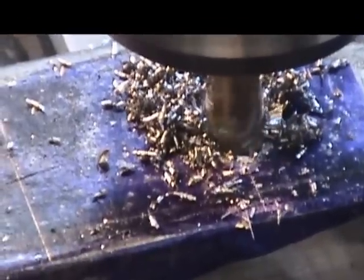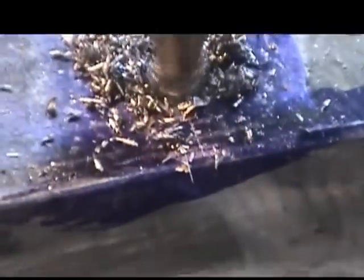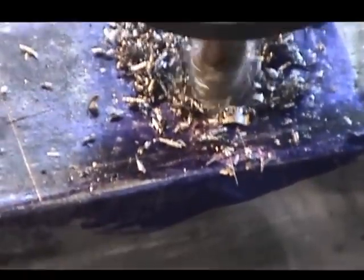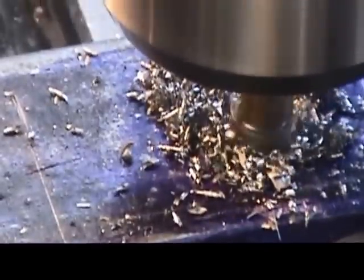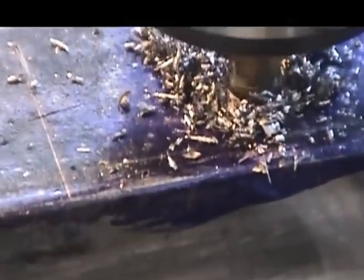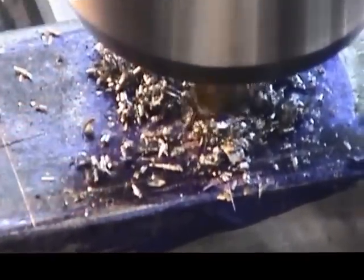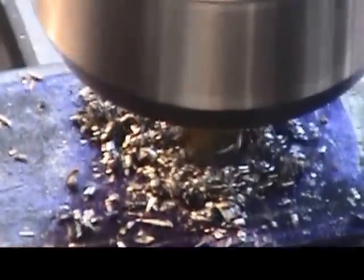I'm going from one access hole like these to milling this section out through the middle, as well as taking it to finish width. These holes that he's milling now will retain the wooden blocks in position as they're bolted to this spider, which is called a spider. And we'll show you some of the other components here shortly with it. As in the first video, we showed you a 6x6 square plate with a 3.5-inch hole in the middle, and the 2x2 angle iron has been welded on to that block. Plus we torch cut the shape of that spider up with a torch and then ground and shaped it.